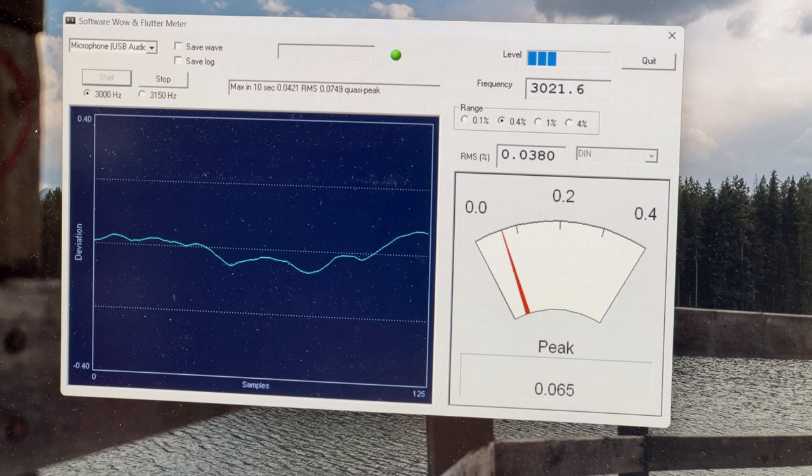So this might turn this deck into a beast. And all four of these capacitors in there right now are currently leaking. They're the dark blue Panasonic garbage caps we got to get rid of. So, yeah, let me get the cover off, and I'll show you how the power supply went.